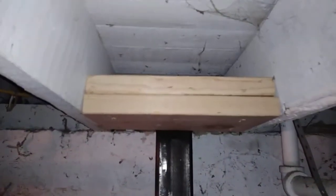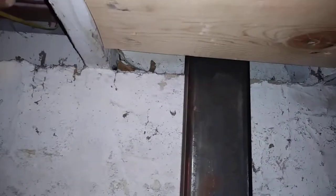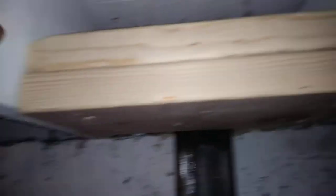There's another way you can do it as well. You can come down and strap double plating to the bottom of the joist and come across it. I've seen guys put plating here, plating here, and then a cross plate this way. But in this particular instance, that's how the engineer had called for it.